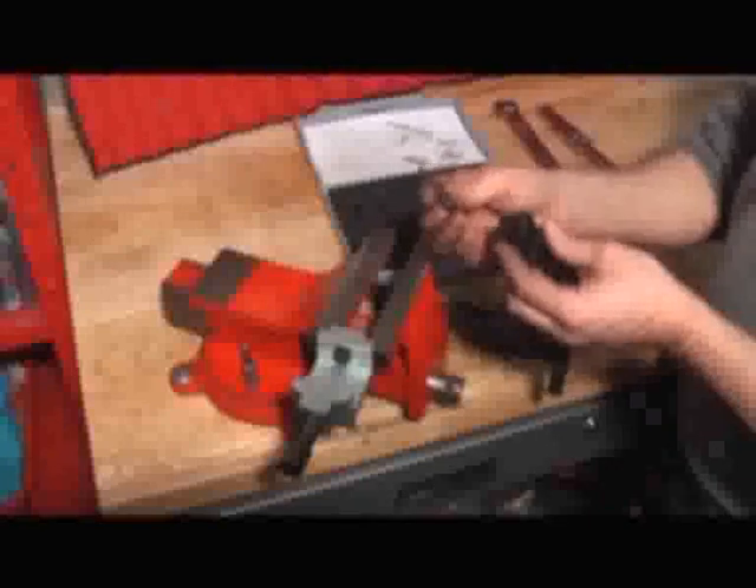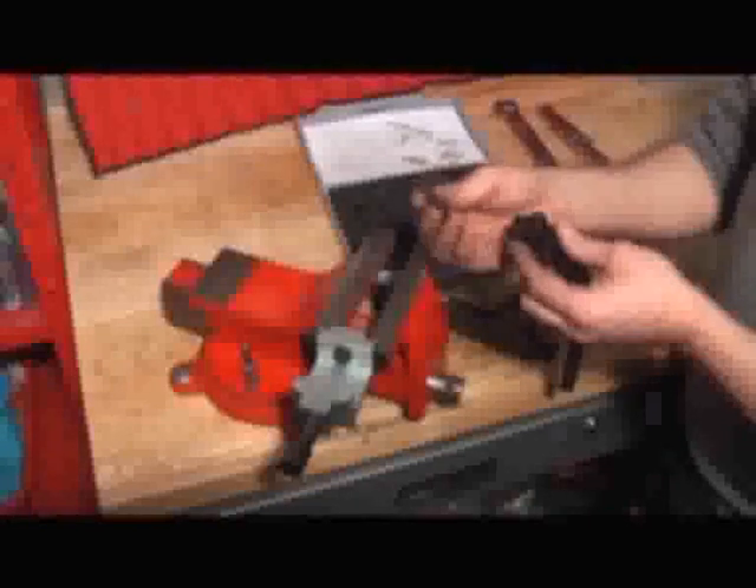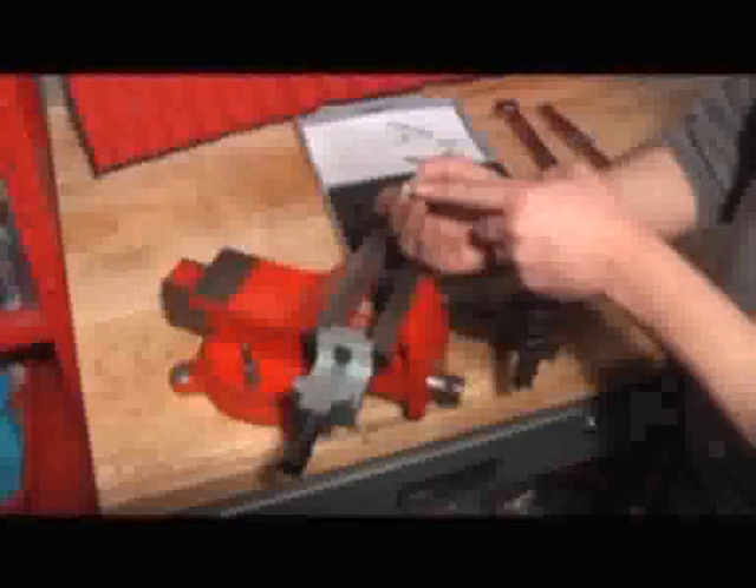To insert the link back in, we need to set the finished unit to the correct link at the back. Some of these dies are blind — they just have the correct setting piece. Insert the setting piece into the back of the extractor and select the correct size punch — that's the punch we used to take the pin out with. The back of it has got the riveting head ready to re-peen the back of the pin.